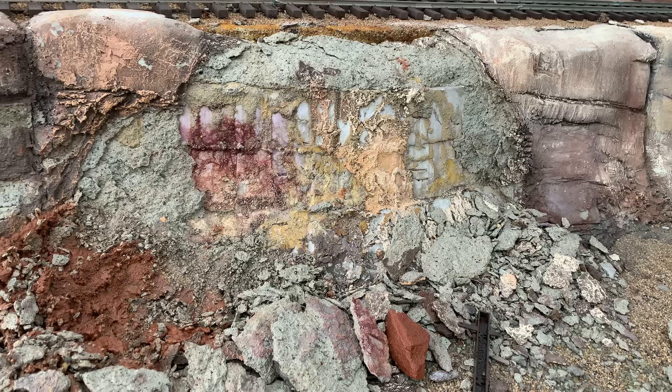I have a theory: I'm just using a plastic cup to scoop the mix out of the bag and mix it directly. If the mix has separated inside the bag - cement coming to the top and sand to the bottom - that could account for this. So from this point on I'm going to dump the entire bag into a plastic bin and make sure it's well mixed before using it.